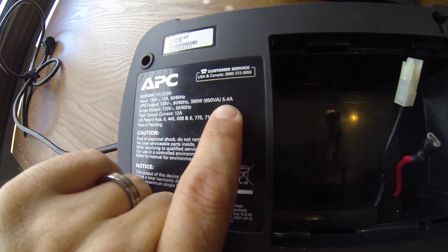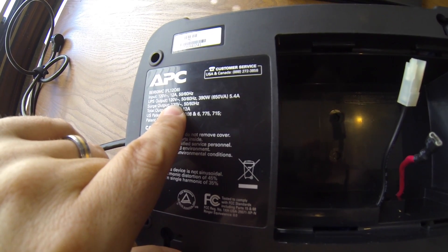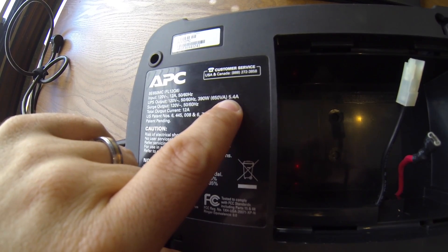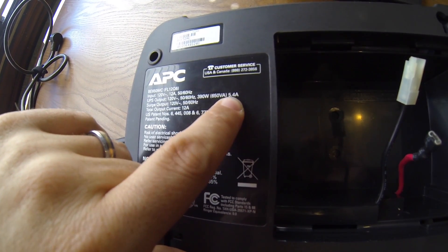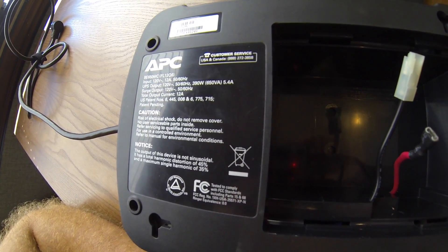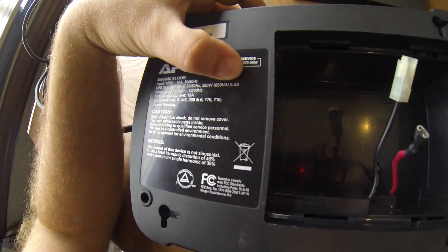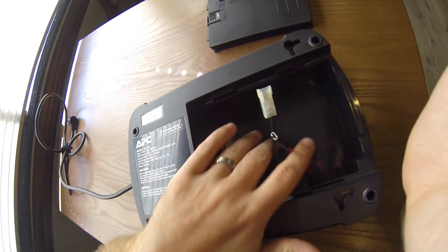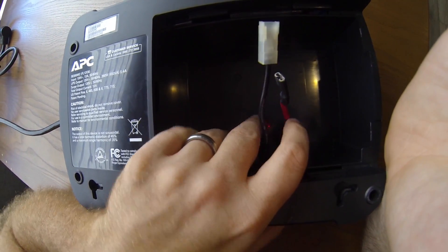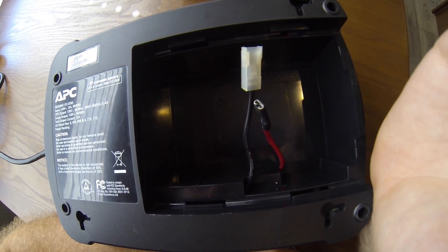It says we're going to pull about 5.4 amps at 120 volts. A quick way to do some math here: since this is a 12 volt unit, if we're putting out 5.4 amps, we move the decimal over one place, and that means we need 54 amps of input power in order for it to run. That's not a 100% accurate calculation, but it's close enough. So 54 amps will run just fine over a short distance over 12 gauge cable. There's going to be a significant voltage drop if you run more than about 2 or 3 feet.